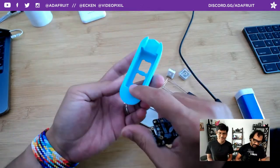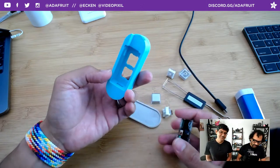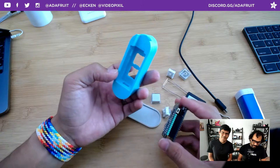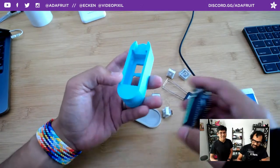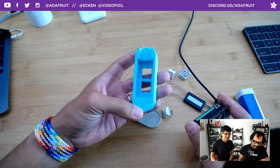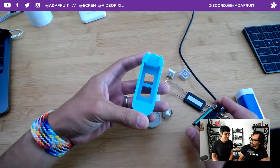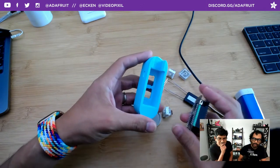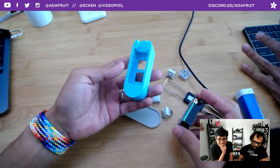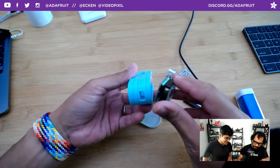And then you're going to need some supports on the bottom here for the overhangs. Nothing too bad, though. Using the exact same modified support settings that we always talk about, with the Z offset being like 0.21, and then the density of the supports being like 6%, 4%. And then the width of these supports being like 0.2, so they're super easy to remove. I've got a bit of access to your USB there. Yeah.